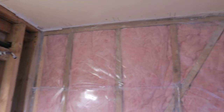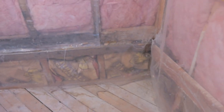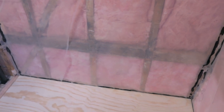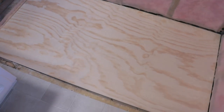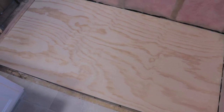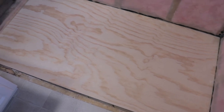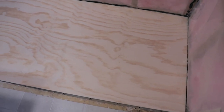Changed my mind — going to start by taking this plastic down, give it time to clean and air out and dry, and see what I need to replace. I've got the new vapor barrier in place, sealed all around, removed old boards and old insulation that had mold in it, sprayed everything down, and cleaned it up. I've got a sheet of plywood in here for a base and subfloor — it was actually cheaper to use nicer plywood since I needed some for another project anyway. The problem is it's a little wobbly, so I'll shim it, level it out, and put a bead of PL Premium underneath so when it hardens it'll help support it and keep it from moving.